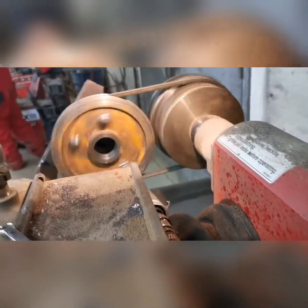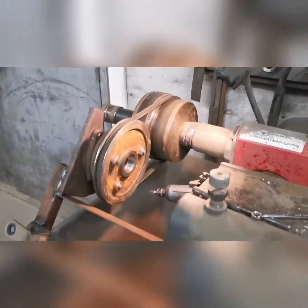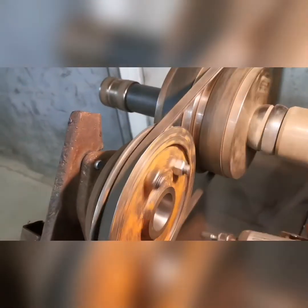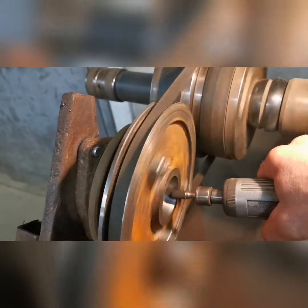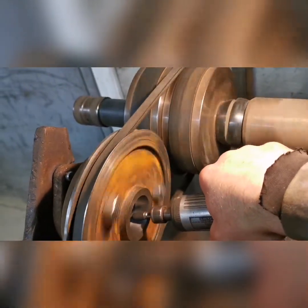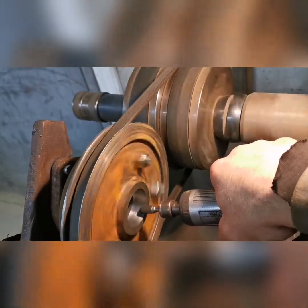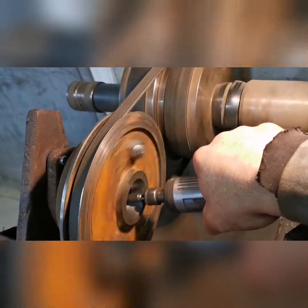The bearings I got for the wheels on my sawmill are a little bit bigger than the hole I want to put them in. So I threw together this makeshift lathe running off of our brake lathe here, using an old worn-out wheel bearing and some steel, and now I'm going to machine out 30 thou off the inside of this hoist pulley. It's an old worn-out pulley off my four-post hoist and I'm going to use that for the wheels on my sawmill.